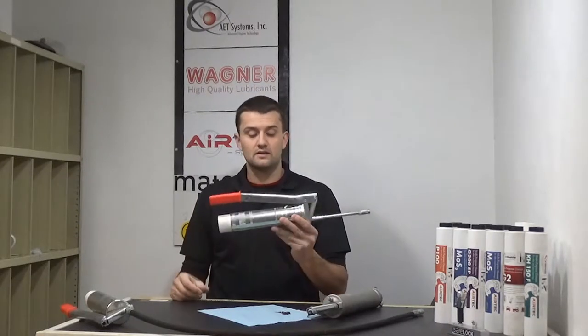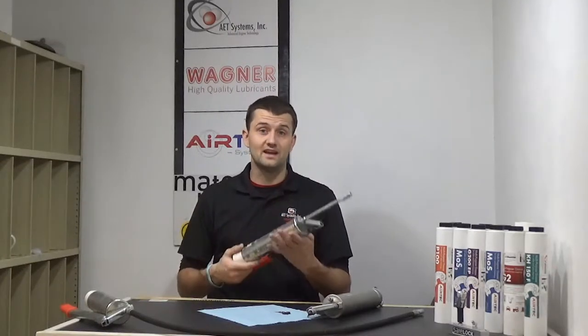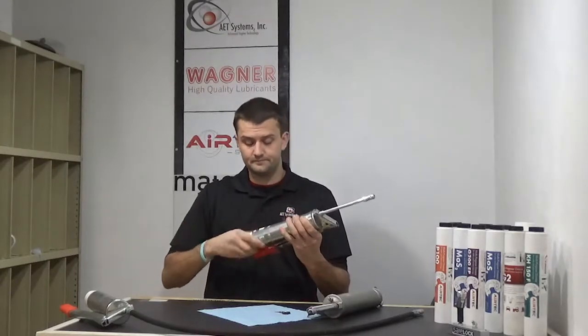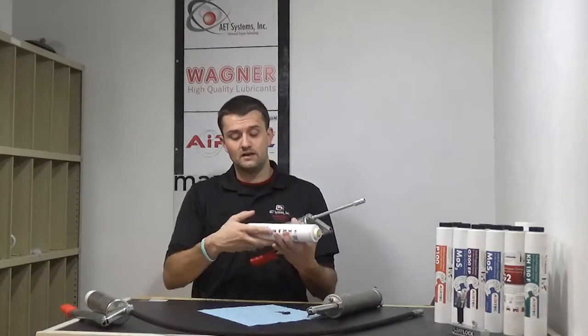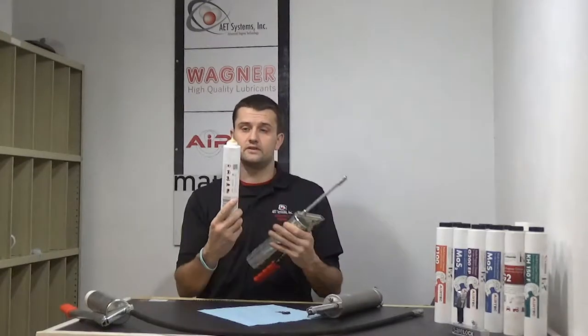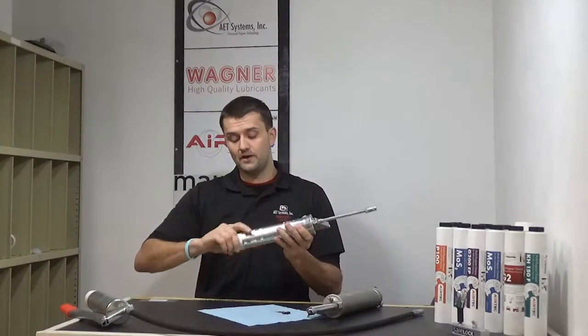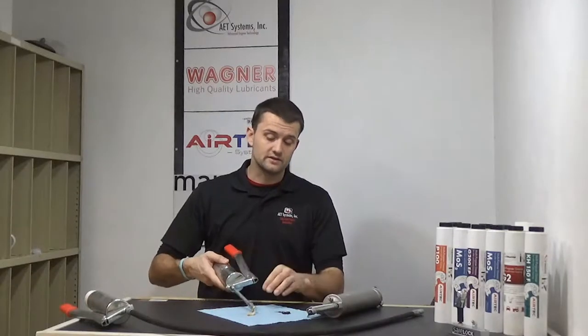Release the spring and you'll be ready to grease. You might have to fight a little bit with an air bubble in the top, but you've got a bleeder valve on top of the grease gun to assist with that. That's the standard grease gun we're all familiar with. You might also run into this other style of grease gun called Lube Shuttle. It's been around for about a decade and it's very simple. To change a tube, all you do is push it on the bottom — you get about a quarter inch of grease sticking out the top. It's a sealed cartridge, so you just thread it back in. It's sealed on the back end with a follower plate, and then you just start greasing. Those are the two main versions: a standard style or a Lube Shuttle style.